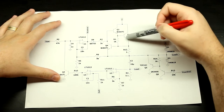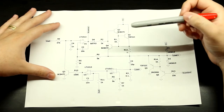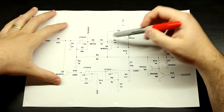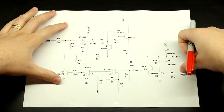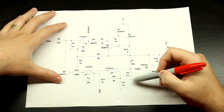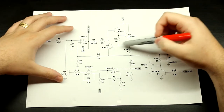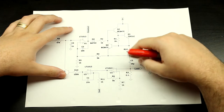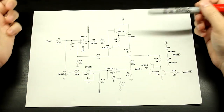The second thing I've added — let's look at this circuit — it's just this transistor and this resistor. We've talked about this circuit on the series pass overview video, which I'll link up in a card. This is just a current limiting circuit, your last resort. Let's say you're drawing way too much current at the output — maybe you've bypassed this resistor by connecting your load directly to the ground point, not the load-minus point — and you overload the circuit. This is what's going to protect it. In this case it's set up for 600 milliamps — I was just simulating this circuit and put a low value just to test it out.